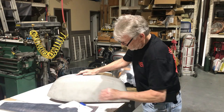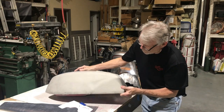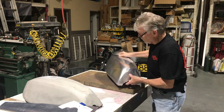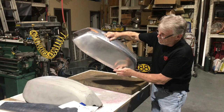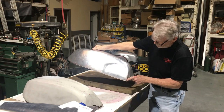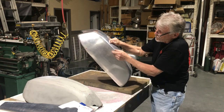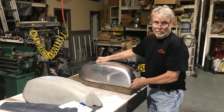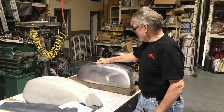And then probably the hardest thing — something that'd be really hard for anybody to do any other way — would be to make these chevrons in the tank. I just showed it on the alloy tank here. It's got a little chevron shape in it right here; this is the original design. You can also see a faint line coming up from the corner, about an inch wide strip with just a faint body line that comes up. That would be just impossible to do by any other method. So this is why I stick to this method.